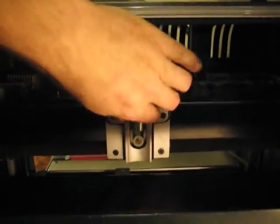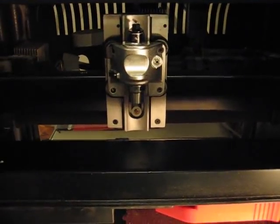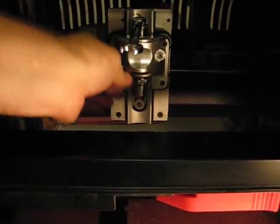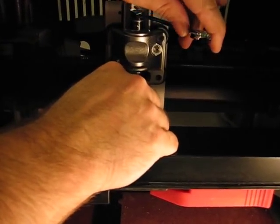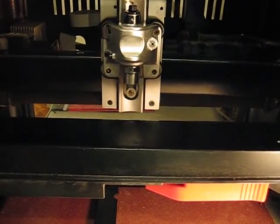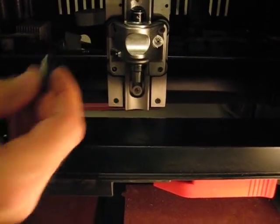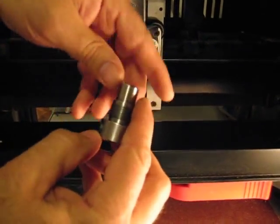At this point, this piece isn't real tight. You can tighten it just snug with your fingers, or you can use the gear wrench with one of the thin wrenches and just give it a little snug — it doesn't have to be tight at all. We're going to pull the square tool out of the top, and at this point we're ready to screw the bit adapter into the chuck.